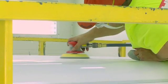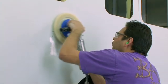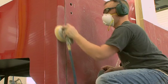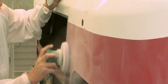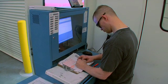The cab is baked at 180 degrees for an hour, then sanded and buffed. All surfaces are given a multi-step sanding, then buffed to a shine. Our craftsmen use a wool pad first to eliminate swirling, then a foam pad for final finish. The cab's paint is given a final inspection before moving to the trim line.